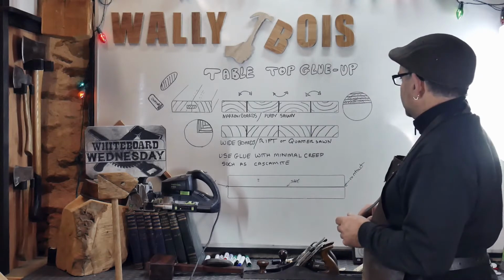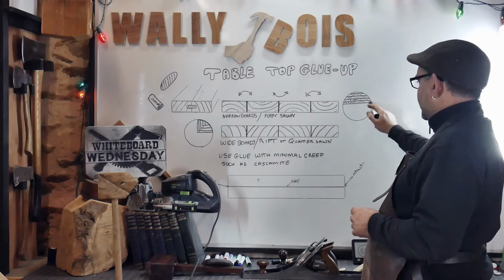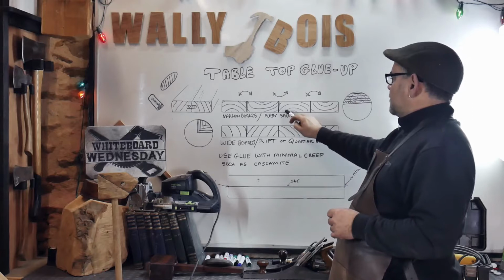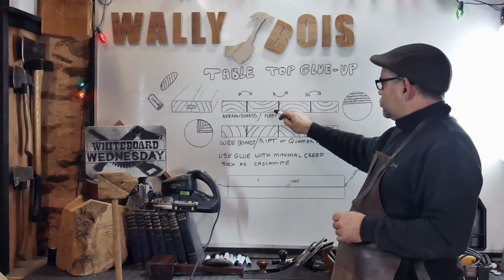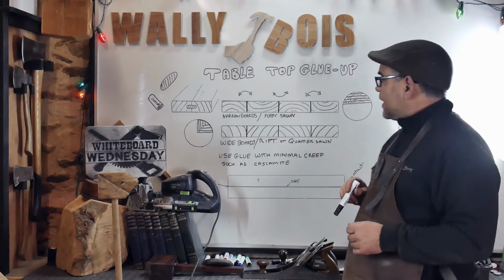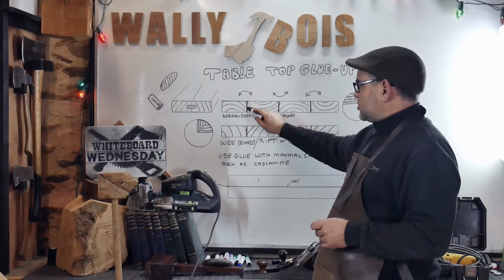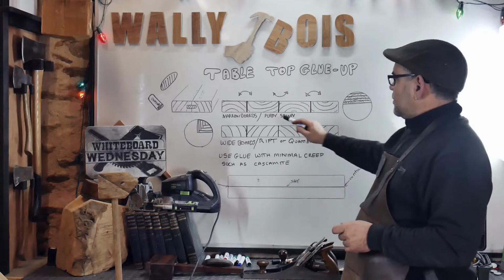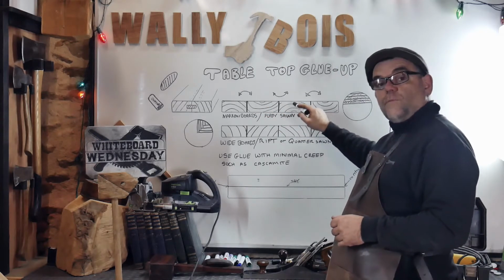When you've got plain sawn, it's generally cut all the way through the tree, and what you'll end up with is a certain amount of the boards having this form where the grain enters from one side of the board but also leaves on the same side of the board. There could be slightly different variations of it. If you see this example here, it stops and then it starts again because the board's been cut in its thickness.